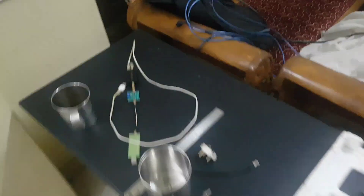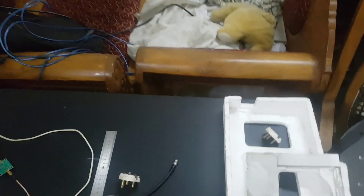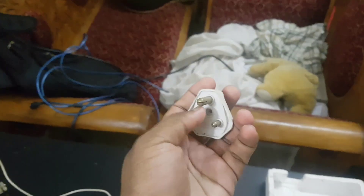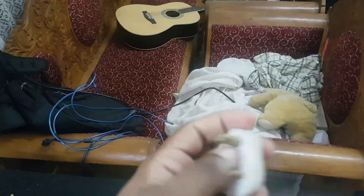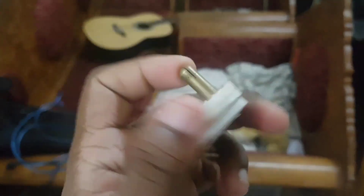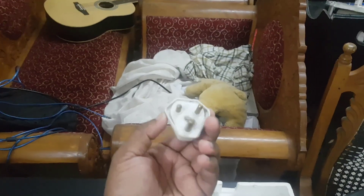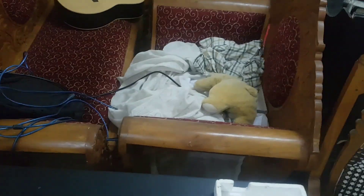We need to make a CAN antenna. I bought this jug from the local market — easy to find in Sri Lanka, India, and Bangladesh. I made a hole to place the antenna element inside. I used a conductor from a laptop for the antenna element. If you don't have this type of laptop conductor, you can use copper tube or copper wire instead.